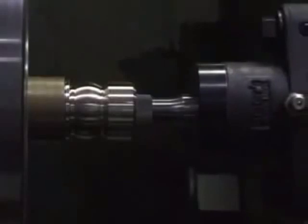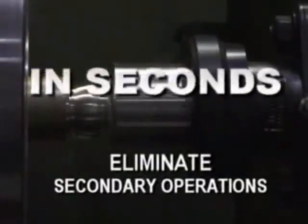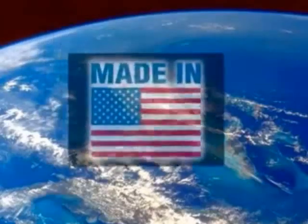Fluids play a minor role in rotary broaching. Any type can be used, and the amount of heat generated is very minimal. Cycle times for rotary broaching are very short — it only takes seconds to successfully complete complex part geometry.